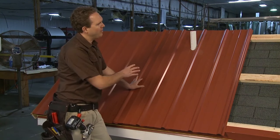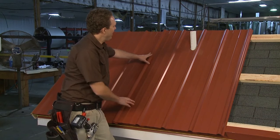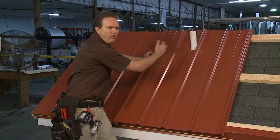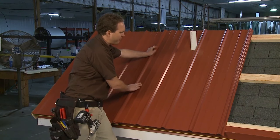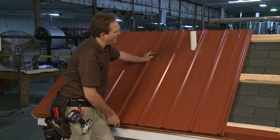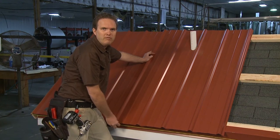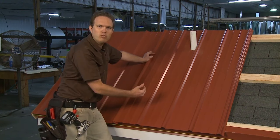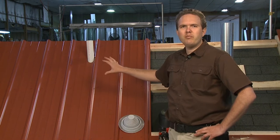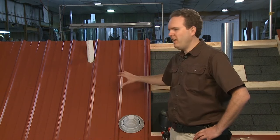We got the hole cut, the panel is up on the roof over the hole to dry-fit it. The rib sits down really tight — that's what you're looking for. If the hole is too far to one side the rib might get kinked up. The panel isn't coming all the way down to the end, so the hole needs to be trimmed down a little bit on the top. We trim out about a quarter to half an inch and the panel drops down and sits in the right place. After trimming the hole a couple of times to make sure the panel sits right on the bottom edge and along the ridge, we got it screwed down and we're ready to put our flashing in place.